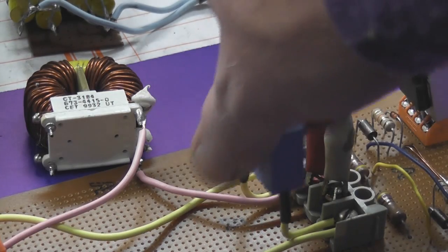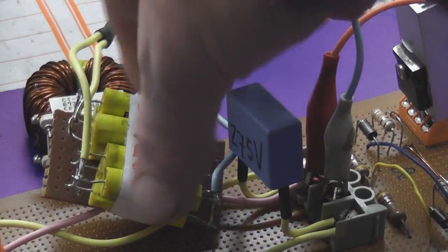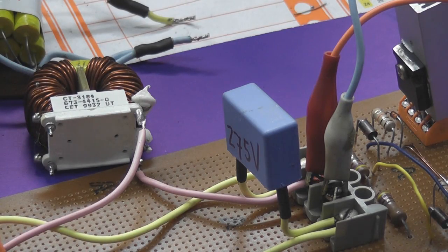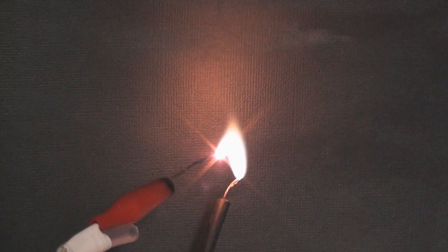I find that a single capacitor usually gets warmer after a while, so I find it better to have a cluster — I've got a cluster here of eight capacitors, one kilovolt rated, and they don't get warm. The negative electrode seems to be a lot hotter than the positive — can melt copper quite easily.